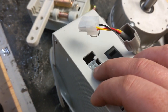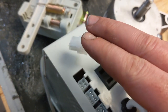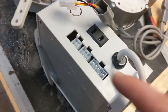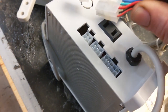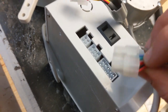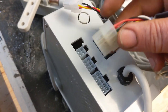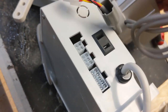This is for what's called a position sensor. When you're sewing, it tells you where the needle is, and so you can try to have it stop in the down needle position or the up needle position. Obviously for a lathe, I don't need to use that. So I don't know. All these pins should be being used. There's 2 that aren't used, but what you have in here is the 3 phases of the brushless motor, and then you've got a power and a ground, and that powers whatever kind of sensoring is in the motor, inside this motor body.